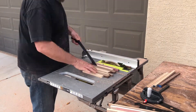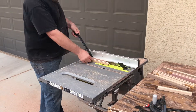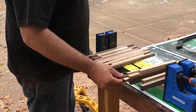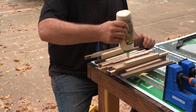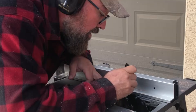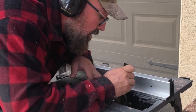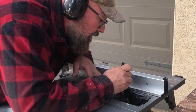We're going to rip these small scrap pieces up for the last time, get them glued up and ready to add to the board. When you're gluing up, you want to use enough glue to cover the whole area, but don't use too much or they'll be sliding all over the place — a little bit goes a long way. Don't forget to change your ripping blade to a crosscut blade at this time, because you're going to get a lot of chip-out if you try to use a ripping blade now.